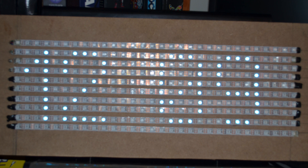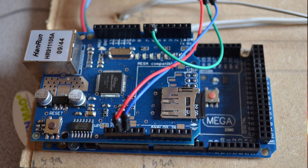The project has several features. From a hardware perspective, this is using an Arduino Mega. It is entirely possible to use an Arduino Uno but I found I was running out of memory, really taxing how much I could store on the Arduino. Originally I was using a Wi-Fi shield but there are so many problems with that I've completely abandoned it. I gave up trying to fix it and switched to an ethernet shield, and everything is so much easier, works, and is reliable.